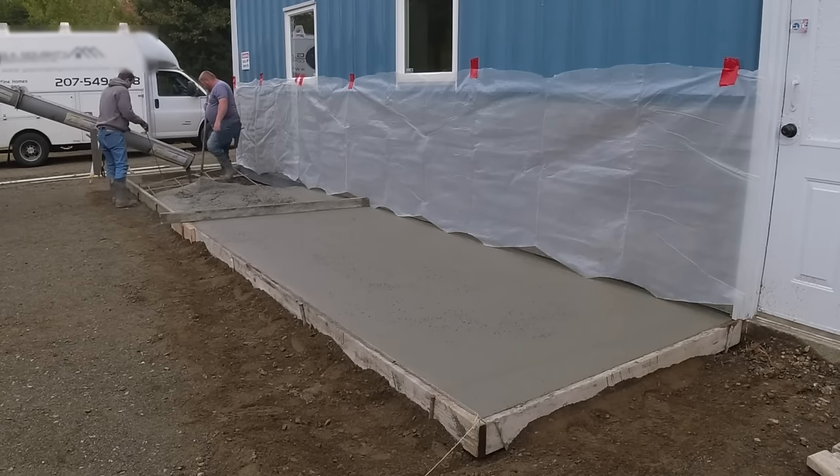See how nice that works — it saves a whole step from getting on it by hand. Luke's coming behind me getting the part next to the form — if there was a tiny little bit of concrete that sagged, he's just scraping that off and getting it right flush with the top of the form. There's a step-by-step process to doing everything when it comes to finishing concrete, and timing is really the key. I teach all that in my Concrete Underground training course — you can learn all about the timing and the steps we use to finish.